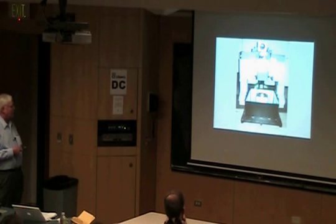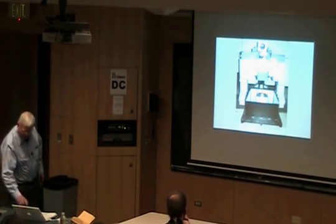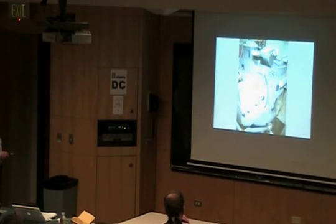This thing is like a moat. It's a tank that holds a high-density silicone fluid and has a float in it of similar size that's used to hold the heavy vertical slide up, so we don't have anything in the way above it. So again, it's a 3-axis machine with rather beautiful control. Look at it from the angle, you see all kinds of air gauges and controls. You see linear electric motors. That works very well.